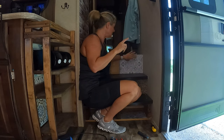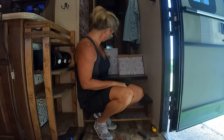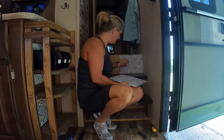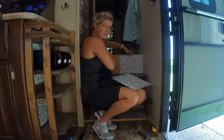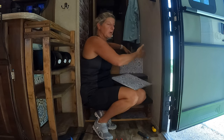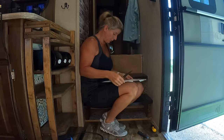I had my first piece cut. Because the steps — I didn't want the tile to look cut off — I wanted it to be even in the middle, so I cut equal parts off of the top and the bottom of the tile. I'm going to do two big pieces and a small piece, and then on the next step I'm going to do two big pieces and a small piece. This tile is super easy to cut — all you need is a pair of scissors, and it worked perfect.